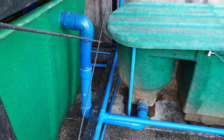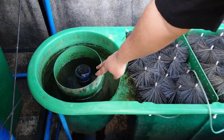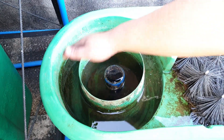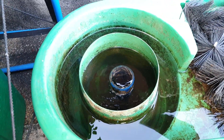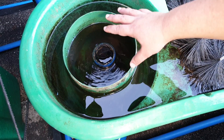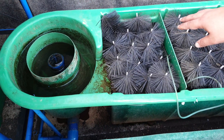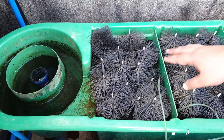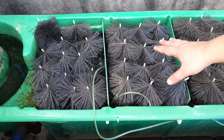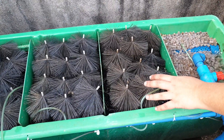Let's open the 7-stage filtration. Our first part is the radial flow. The radial flow has a cone and the cone prevents waste from exiting the outer part of the chamber — it's forced down. We have a drain valve at the bottom so we can clean or maintain this radial flow part. From the radial flow it goes to a brush filtration, then down and up again to another brush filter, and then to a third brush filter.